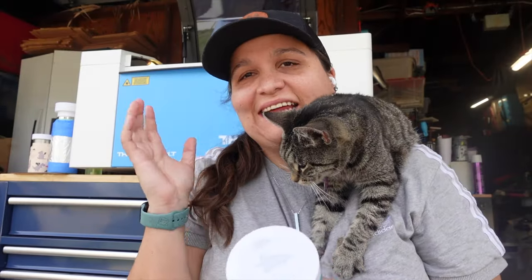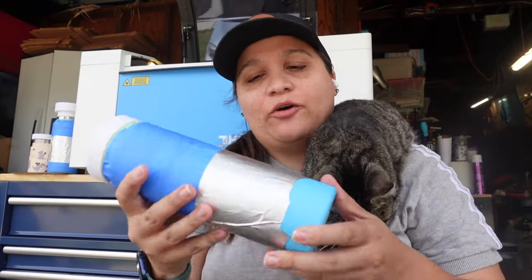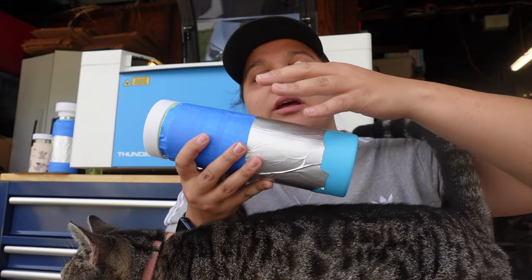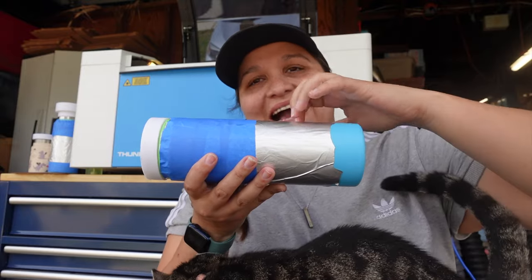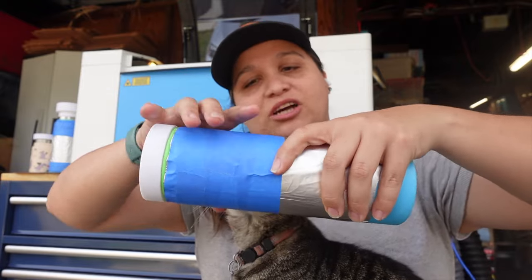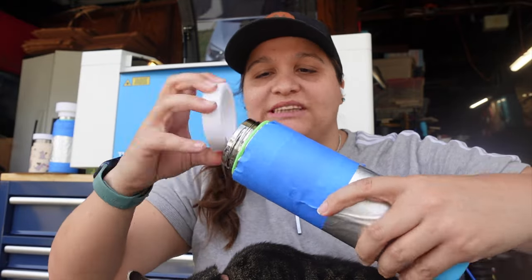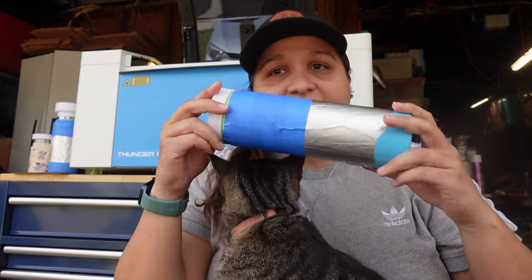It is the next day — I decided to just end my day so I didn't mess up a cup even further. We have our 20-ounce tumbler here. What I've done is put a piece of foil around it and taped it down. The foil is to hopefully make it so that if the laser beam goes through the tape it's not going to actually mark our cup. Since we're just doing our one-inch square test, I only taped up the top part. This tumbler was a little bit too small to do the clamp in the rotary, so I just 3D printed a little attachment for it so it'll spin freely with the rotary. Let's put this in and see what happens.